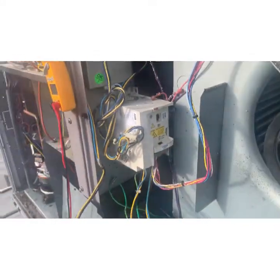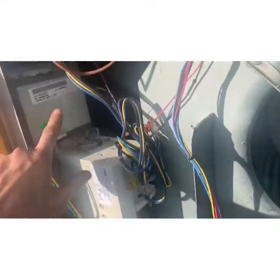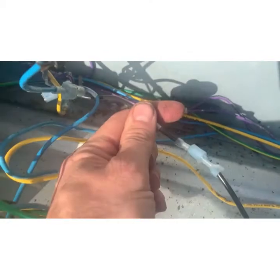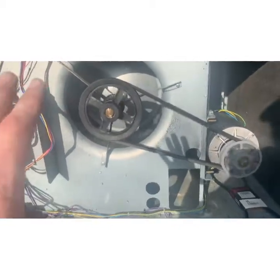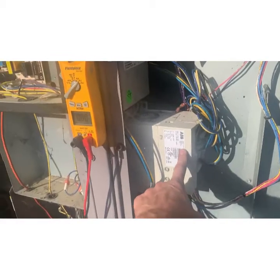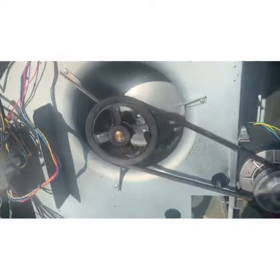She's running - and here's the recap. Power was good coming out of the fuses. The manufacturer built this to be bypassed. This is the black wire from the motor, this is the black wire from the fuses - it used to run into one side and out the other of the VFD; now it's not even connected and power is running straight to the motor. The motor's going to run all the time - 24 hours a day - but it's the blower motor, it can handle that for a few days while I sort out whether we replace the VFD or bypass it with a contactor. This is the kitchen, it's got to get up and running, so we'll close this up and do some research on that.